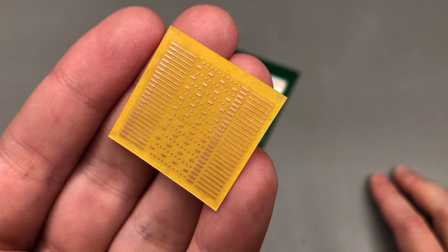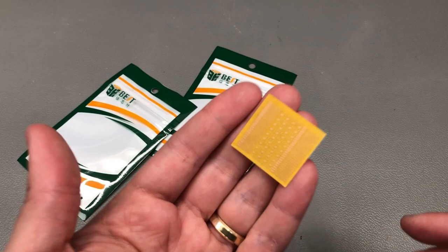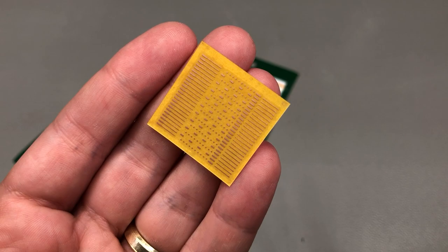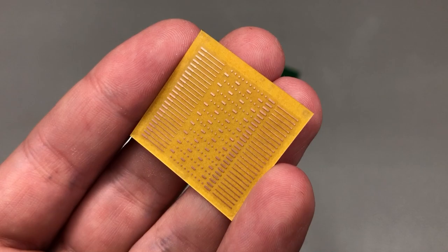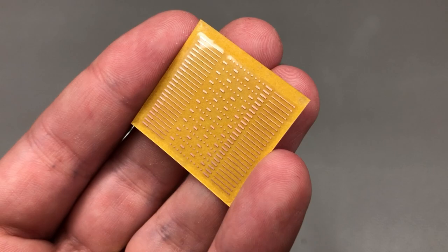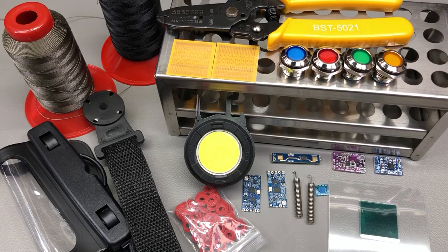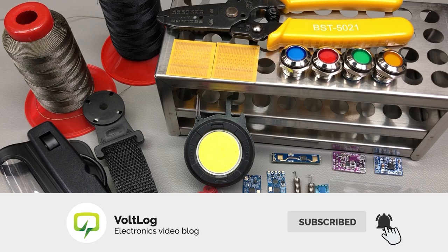The last item in this mailbag is a very interesting set of copper pads for PCB repair. If you've ever done micro soldering or modern gadget repair, you've likely encountered lifted pads — the copper pads are so small they detach from the underlying FR4 substrate when heated. Usually you run enamel wire directly to that pin, but there's an alternative: these kits of individual tiny pads in various sizes and shapes that you can use to recreate the original pad. I haven't tried these yet but I'm happy to have discovered them. They're very affordable and well worth getting a set. That was all for today — links for all products will be in the description. Thank you for watching; you can support the channel on Patreon with as little as $1 per month, or just hit the like button. See you next week.